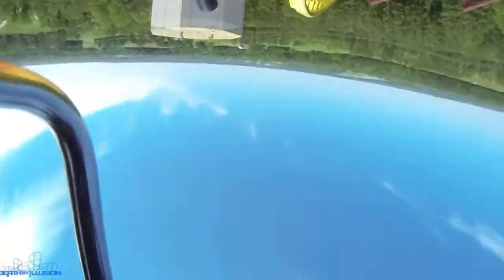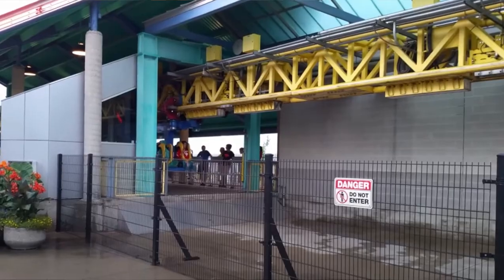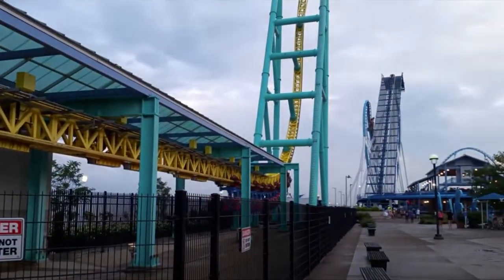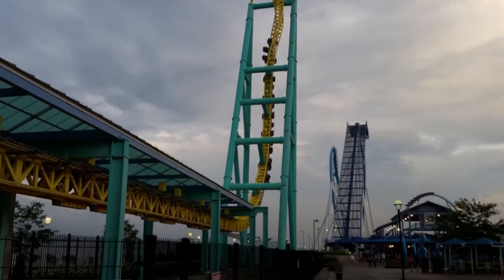That way they're able to create the current and collapse it quick enough as the train passes by. So those big workhorses in the station that are used to shoot the train out would not be a good fit for the other end of the track, where they have to accelerate the train up to 60 miles per hour or something like that. So there's a difference in stators.